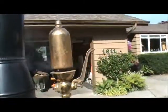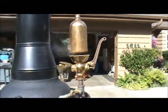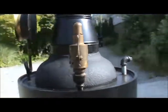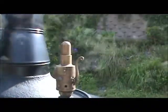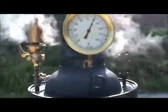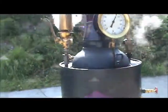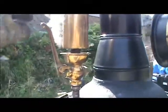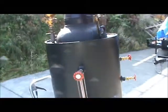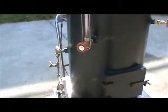Antique whistle here. This pop-off valve is set at a hundred but it goes off at 90, so it's at 90 right now. Antique gauge, and it should pop off here. I'm starting to let some steam out. I'll blow the whistle here and I'll pump some water into it.